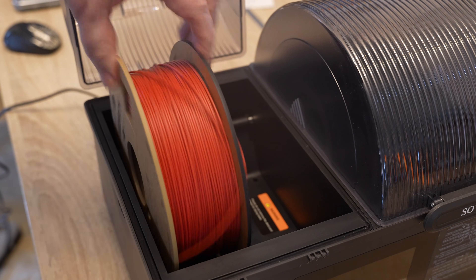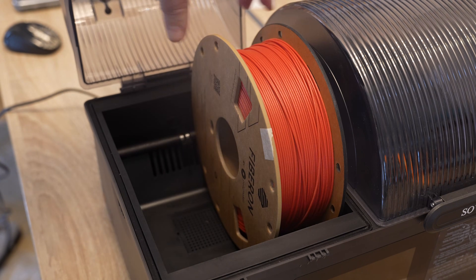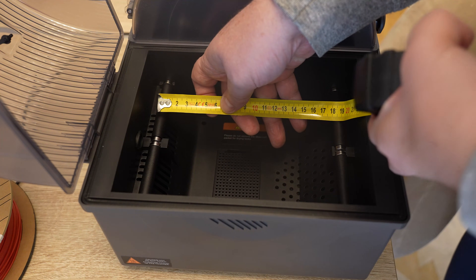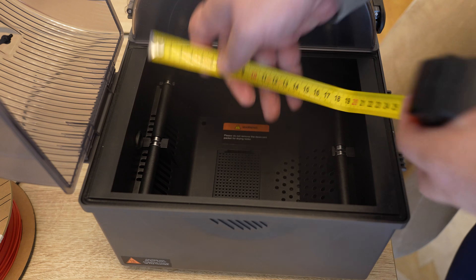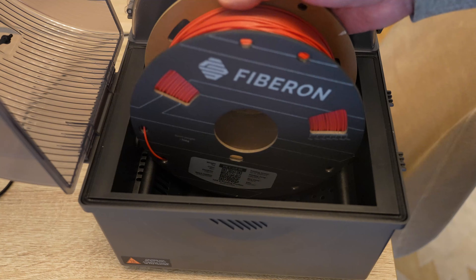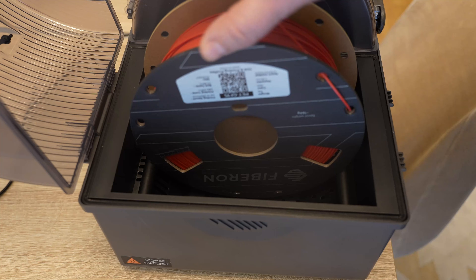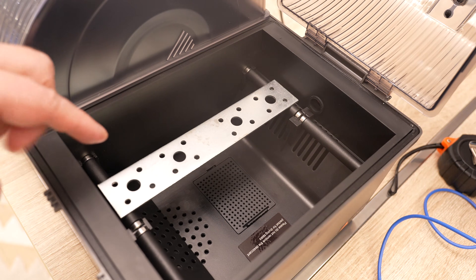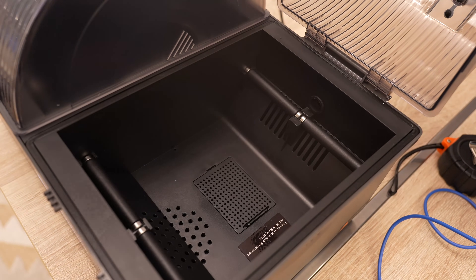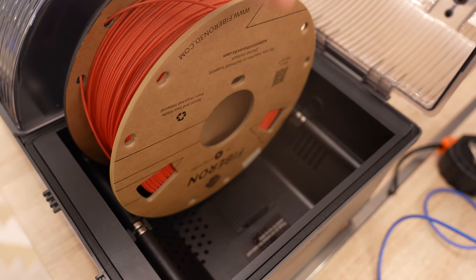The rotating is not too smooth. I think I found the problem — look at this distance between rollers: more than 18 centimeters, almost 19. When we place a spool it sits very deep inside and pushes quite big forces, which is why it doesn't roll easily. The bearings themselves are smooth, but because of the large distance between rollers, the friction is much bigger when a spool is inserted.